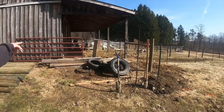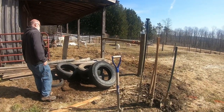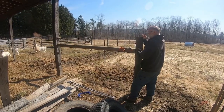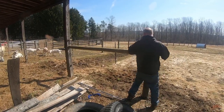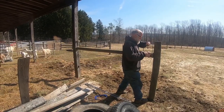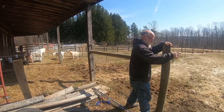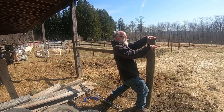So this is the top of the brace wire. It's gonna go down this way — you always point it in the direction of the fence. So it's gonna be down low here, up high here. Wrap it twice, put on the strainer, tighten it up. What that does is it pulls this pole tight to there, which will keep the fence from sagging. That wire pulls down — the strongest part of the pole is down there — and it pulls the top piece against this pole. So when we wrap the fence, the tension keeps it all together.